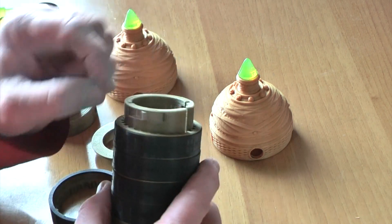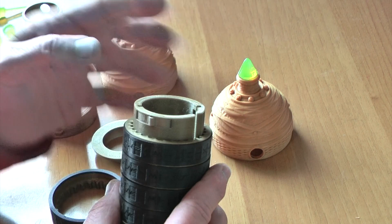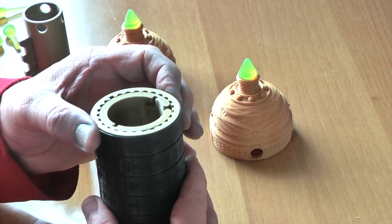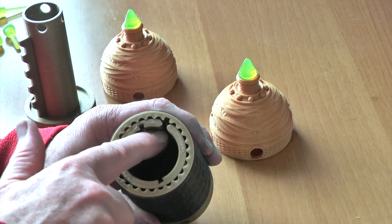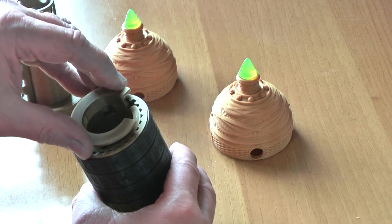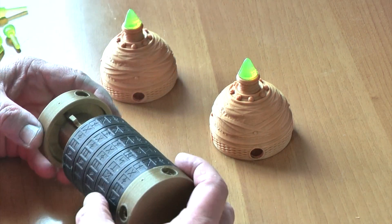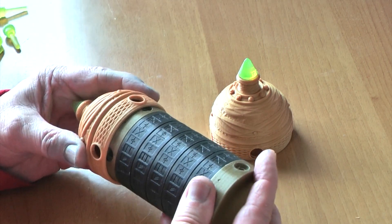Just to help with indexing - on every ring on the main cylinder there's a little pressure spring. That little pressure spring gives it that ratchety feel; you might hear the clicking - it's that little spring that gives it its positive positioning as you go around. To put it back together, we need to get the square on the ring lined up with the groove in the cylinder so that it goes back in. Then we put the locking ring back on and click it in to hold it all together.